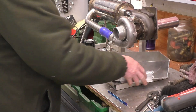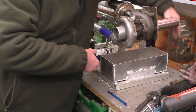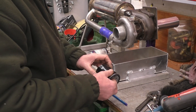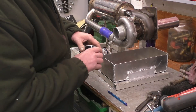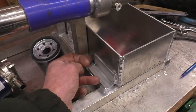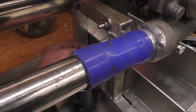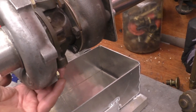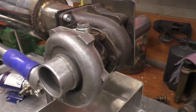There'll be two securing bolts going there and two more securing bolts in there as well. So basically it's starting to take shape quite nicely. That's the filter I'm going to use — I've checked the thread, it's a 20 by 1.5mm thread so I can make a filter head for that no problem. I might get a bigger filter which holds a little bit more oil. There's an oil cooler to consider because these things heat oil up really quickly. The oil outlet goes in there and oil return probably into there — that's a return from the bypass pressure valve. There's an oil drain underneath here and the oil just flows straight out into the tank.